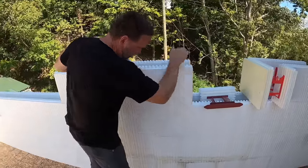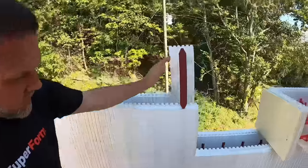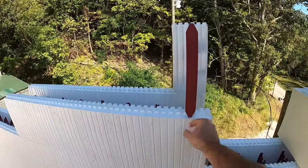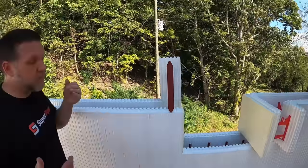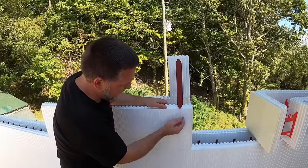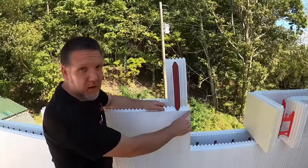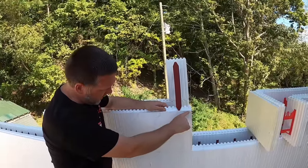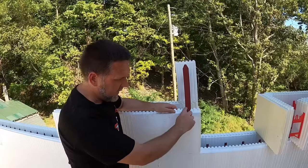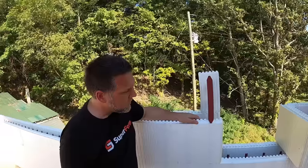You see what he did there was line up his studs. And without foam, this is what it looks like on the inside of that EPS. You may get the question about why the bow tie shape. If we were to peel that foam off, it would make a bow tie shape. That's designed that way for running electrical. You run your chainsaw right through this area when you're making an electrical groove, and that's less of the polypropylene to cut through.